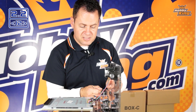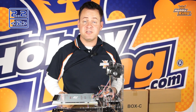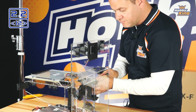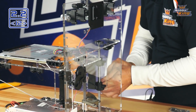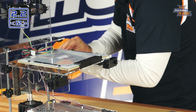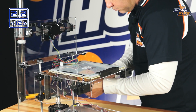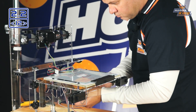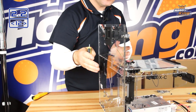Now that all the screws are loose, we can see there's a lot of flex and motion in here. If we give it a little wobble, all the rods and the bearings are going to find their natural center. The tightening sequence: first go ahead and tighten up these side plates, followed by the top back plates. I'm going to go ahead and do that now — tightening the side plates first pulled tension on these rods outward. Now we're going to tighten up these screws right along the back side, which is going to tram it this way.